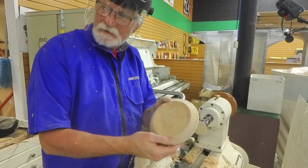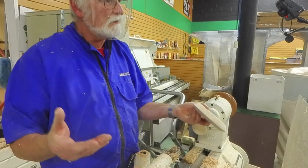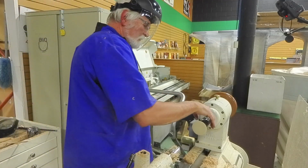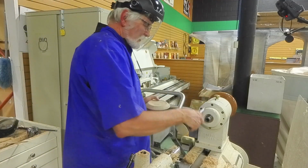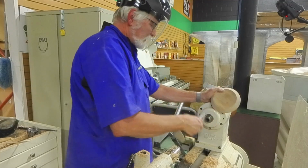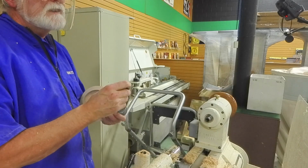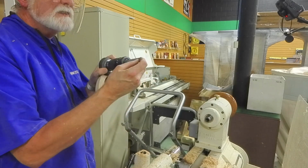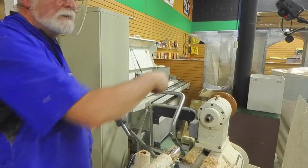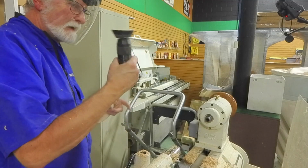Look at this one, John. You can get a reasonably flat finish on that. Bump is gone. And how long did that take? And hopefully you have a Jacob's chuck. But you got to be careful. You do get loose. Some of them want a drawbar, or you got to jam them right in there. What's a drawbar? Some all thread that'll go into this. So a threaded rod. It comes out the other end. And you screw it in here and you screw something on the other end to hold it tight.